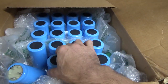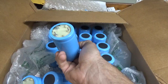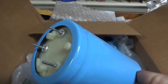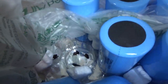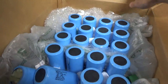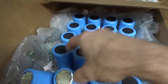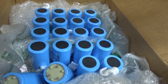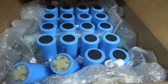So these will all be in series. This one doesn't look bad. That one's bent a little bit — they may have already been like that, because they have holes that they go through. So I'm going to condition these. These are really good capacitors. When they're all in the circuit, when I'm ready to fire it up, we'll bring the anode voltage up in stages to — I think he said re-something, I might forget the exact term.